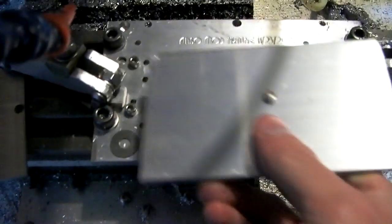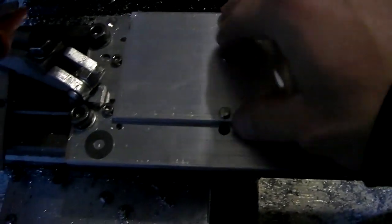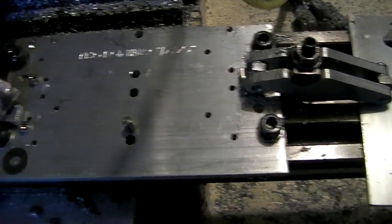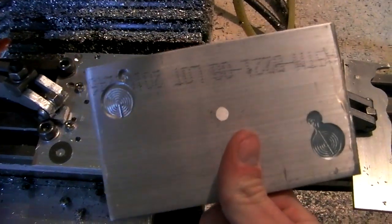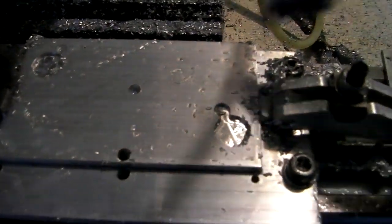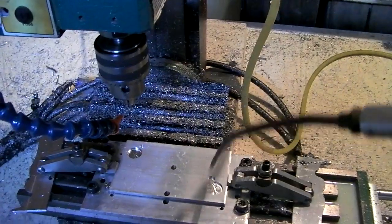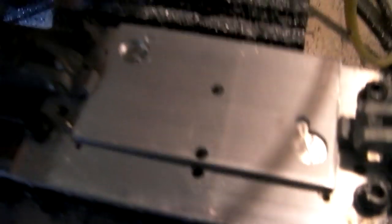So once I put the pins in, then I can flip it over. I use the pins to locate it, and then I use my finger clamps and clamp it down. That's a lot of talking for not a lot of results. So basically, I'm going to make another one of these right now with proper offsets and locations. Alright, let's check this guy out and see if I got it right this time. As far as I can tell from here, them holes are bang on.